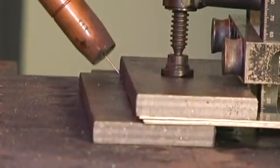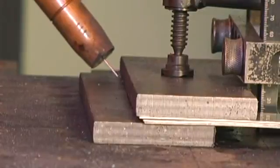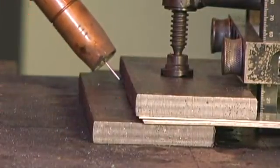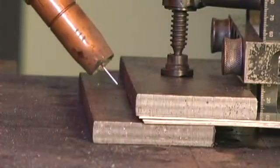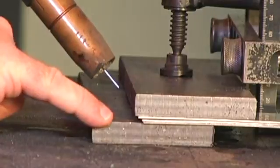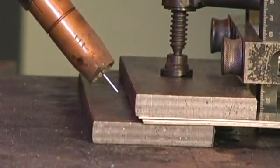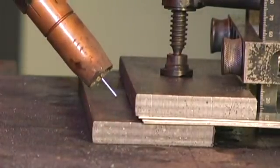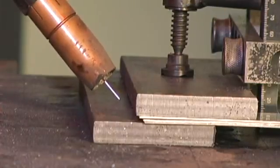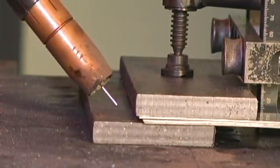What we have here is two half-inch plates. There's no gap at the start of the joint and there's a 4mm gap at the end here, as you can see. We're simulating the tracking at the moment and it's actually going to the programmed point, which is about half an inch out in fresh air, not in the root of the joint itself. In a minute we'll be switching on the arc and the tracking will begin, and the impedance will be controlling the arc to keep it into the root of the joint.